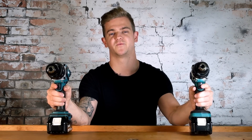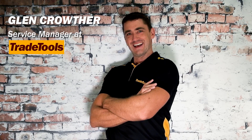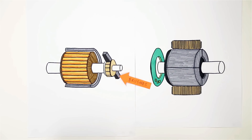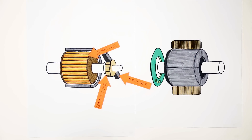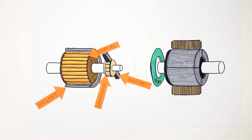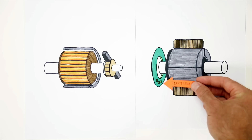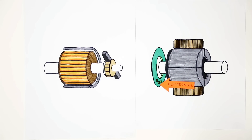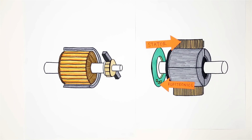To explain how they work, I'll pass you on to our service manager Glenn. The brush motor uses a pair of carbon brushes to transfer DC power to the commutator of the armature. This creates an electromagnetic field that repels against the permanent field magnet of the motor, producing rotation of the armature. Brushless motors are slightly different — DC power from the battery is delivered to the electronics in the unit, which optimize the power output to the stator, creating an electromagnetic field that drives a permanent magnet built around the rotor.